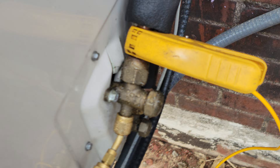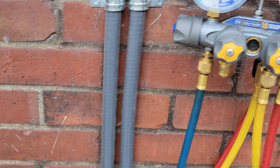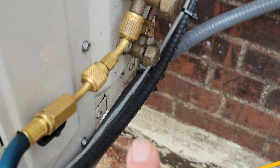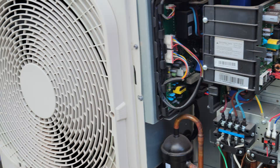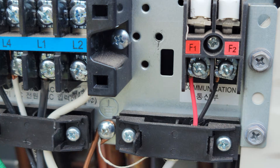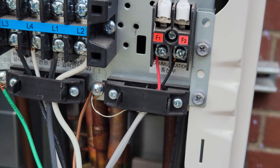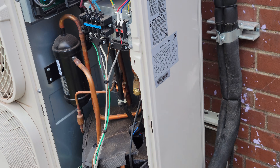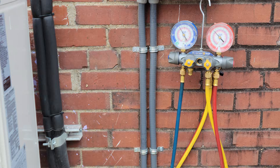Got our fitting to be able to hook up our low side gauge. There is no port for the high side. Make sure those flares are nice and tight — any pressure tests above 580. Make sure you don't get the F1 and F2 mixed up from the inside to outside. Make sure that you ground it at the outdoor unit for the communication. Just a few tips.